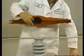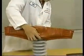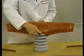As with the bolt covers, we can make vacuum-formed parts for specific applications. Here we are showing an insulator cover used for bird and animal protection — notice how simple this is to install. Overhead Line Insulating Cover, or OLIC, is a preformed spiral tape coated with adhesive. OLIC is easily installed by sliding it over conductor leads, then heat is briefly applied to secure it into place.